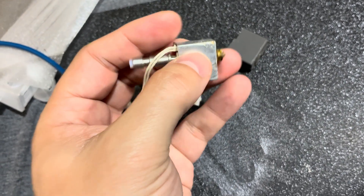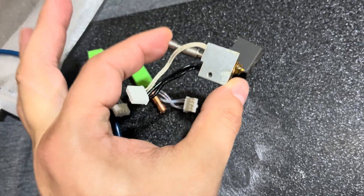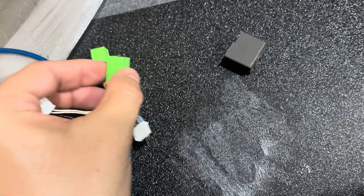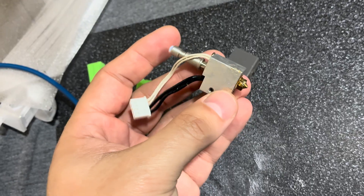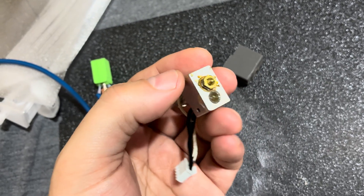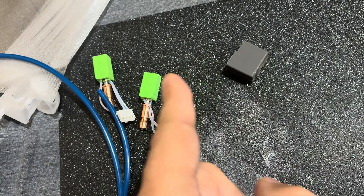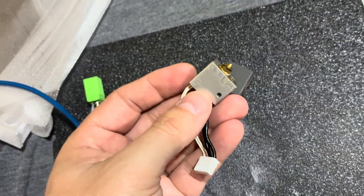Be very careful with this stock hotend. It is a better choice for higher quality prints than the abrasive-safe versions, but I would be wary of the temperature. If you're only printing in PLA, just stick with the stock nozzle — it's a much better option than trying to go this route and micromanage every setting to get the same quality you'd get out of the stock nozzle anyway.